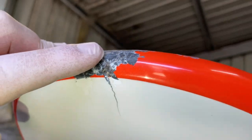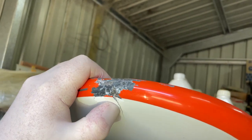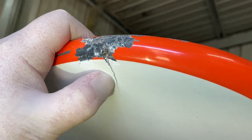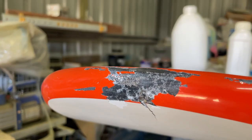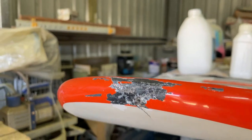Not much damage there because the paint's fallen off, but what we've got here is a crack. And this is the more significant part because, as you can probably see, there's a little bit of movement there. The foam hasn't gone soft, but there's enough movement that we're going to need to re-glass at least this area here. I've left it nose down in the sun for a bit, and no water came out thankfully. Otherwise we'd be doing this in two days' time.